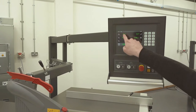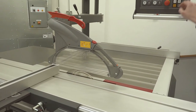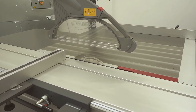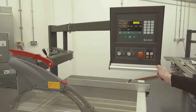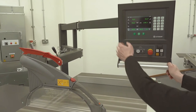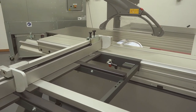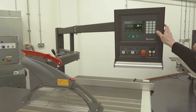From the control system's main menu, we can adjust the height of the saw blade and reposition the angle. Because we've got a full-axis-driven machine, it will automatically compensate for each adjustment we make. The crosscut fence is automatic — this is the Uno system with a fixed position secondary stop. The rip fence is also automatic, and we've got presets for commonly used positions, which is really useful for an operator.